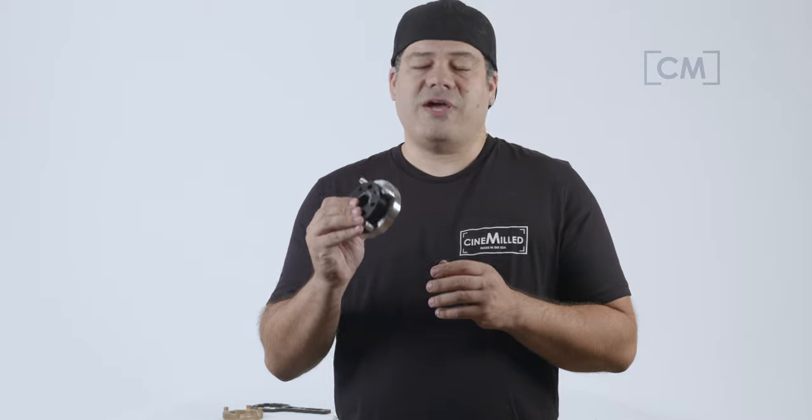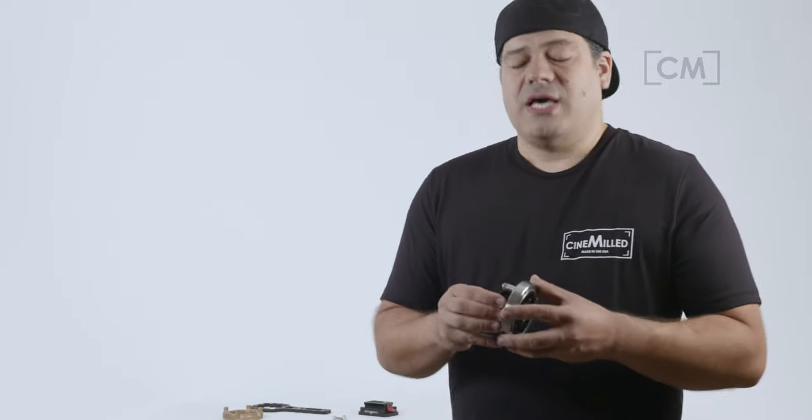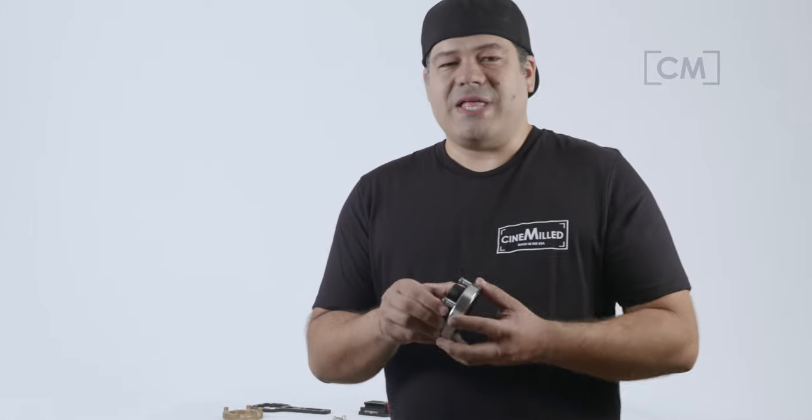It's a pretty simple, straightforward device. We have an aluminum center thread, and this is just a standard thread, just like all the other Mitchell nuts and collars out there. We're using stainless steel for our castle nut, as opposed to some of the other companies out there, so it'll never rust. It's nice and heavy duty. And we're using quarter 20 screws and standoffs for the castle nut area, and that interfaces with our Mitchell wrench.